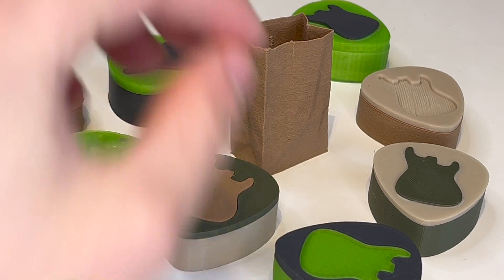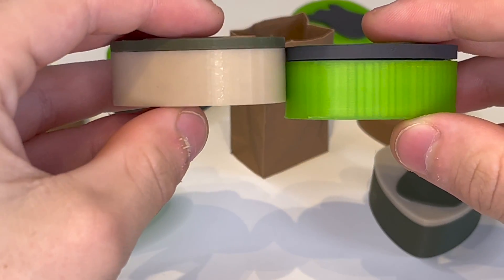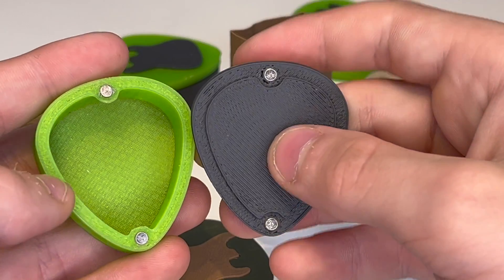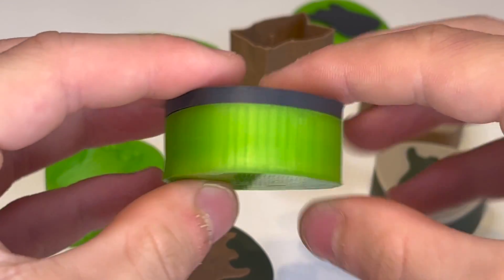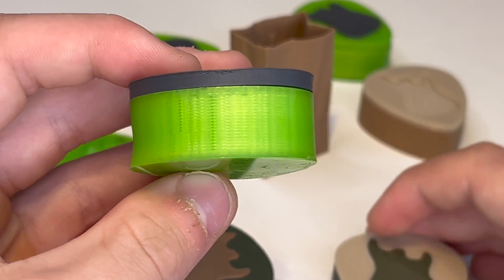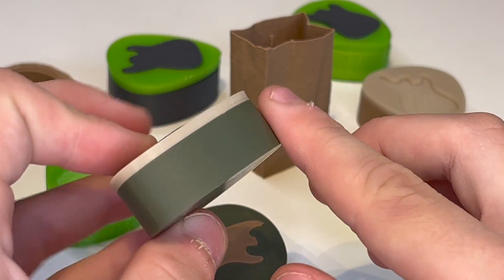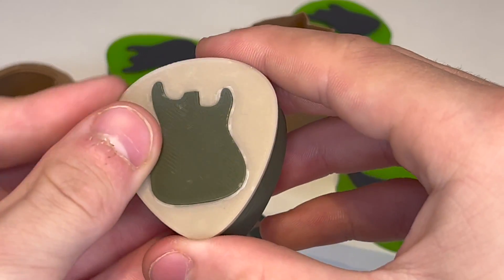Here's the older design — if I get a newer one up, you can see the lid is a lot thicker. Also, obviously, the magnets are not embedded; they're glued on after we've finished the print. This was printed with our old printer, not the Prusa one. You can see it's got a bit of elephant foot — it's kind of warped, not a straight line. The new design, printed by the Prusa, is really straight. The Prusa's done really well. Magnets are embedded, you can't see them. In my opinion, a slicker, neater design.